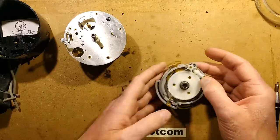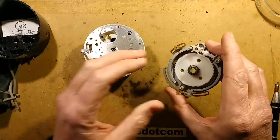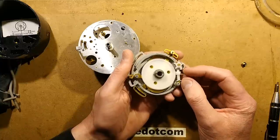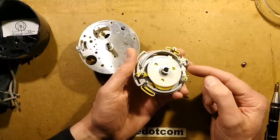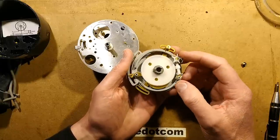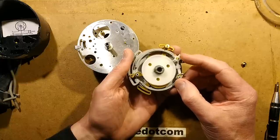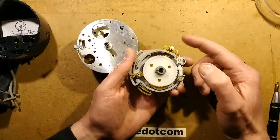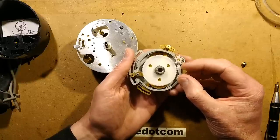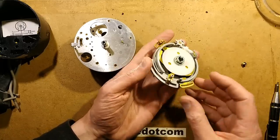The mechanism for that involves a little pin here. As the dial rotates, a pin wheel gets clicked round one slot each time. That's geared onto a worm drive, which is then geared onto another wheel, such that 365 steps represent one year. You can actually see that moving as I click this round — the cams inside just nudge these sections backwards and forwards during the year.